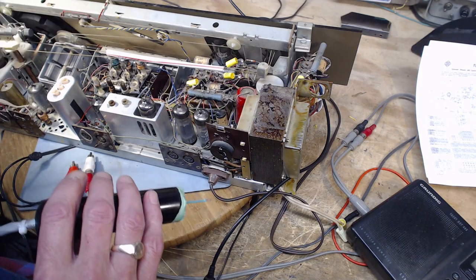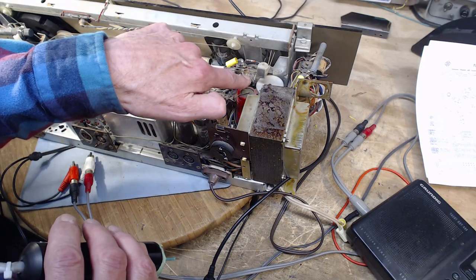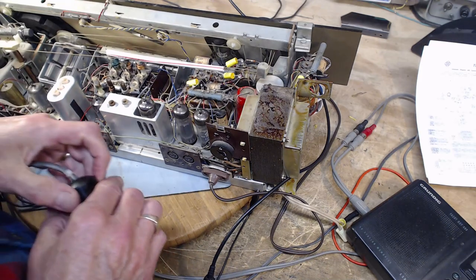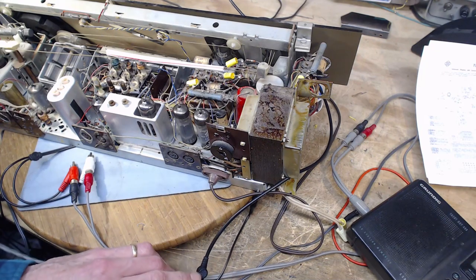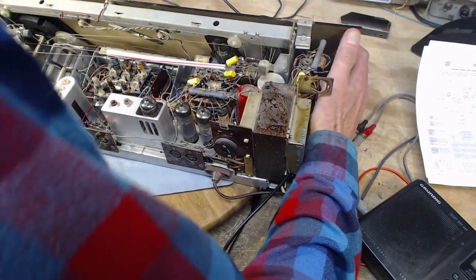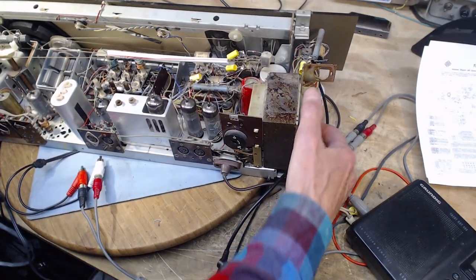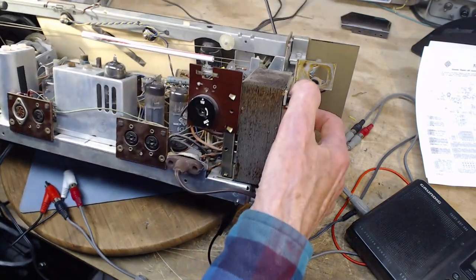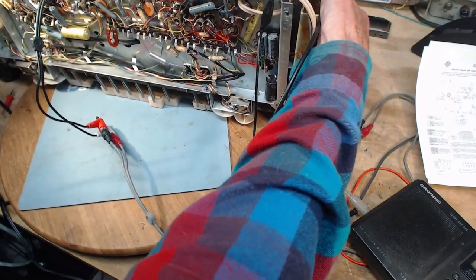From here, everything kind of goes down under. There are two shielded wires leaving the center terminal of the volume control, carrying the signal. I'm going to chase those wires down. Again, the set's not operating. Okay, I'm going to flip this up. This is one of the more likely times for me to damage something, so I'm fairly careful doing this.